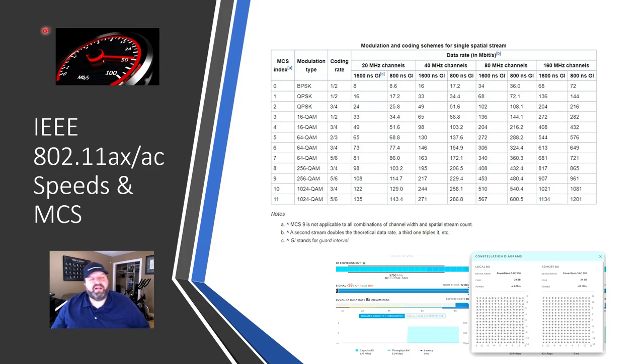Here's a slide that presents some terminology that's probably also familiar to a lot of hams. You might not understand that it's actually using the same tech and modulation methods that we use, just at a much higher scale and broader bandwidth. For instance, the modulation type or MCS index that determines what your speed is going to be for this new wireless standard depends on things like distance, channel width, and the quality of the signal going into your Wi-Fi access point. You can see the modulation types — BPSK, QPSK — we're familiar with a lot of these.